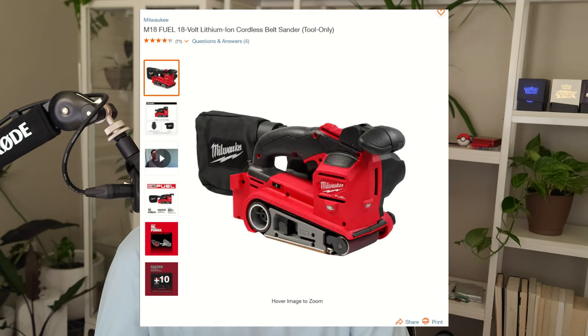Keep in mind I got the birch island top, which is a softer wood so it does dent, and it had a lot of imperfections to begin with. If I did this again, I'd use a power sander and sand with multiple grits instead of just one. I'd also get wood filler to fill in all the imperfections — there were far more on this $370 slab than I'd care to admit. The good news is you can always sand butcher block back down and start from essentially square one.